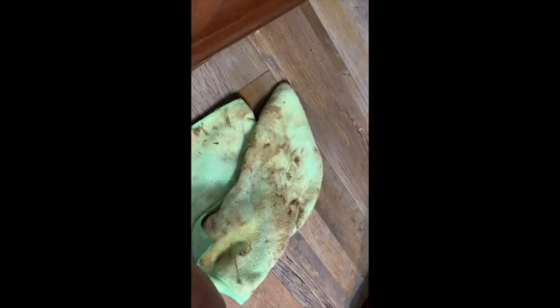My final wipe down is always with a microfiber cloth. When I do it, I look at the cloth and that tells me if it's clean, if it's going to be a bleeder, and what my next step should be. So because it's cherry wood, I knew it would bleed, and that would require priming since we are going to be painting this white. This thing was dirty and filthy, so it took a lot of cleaning. But you're only as good as your clean product — if you want a durable finish and you want the paint to last, you have to make sure that it's clean.